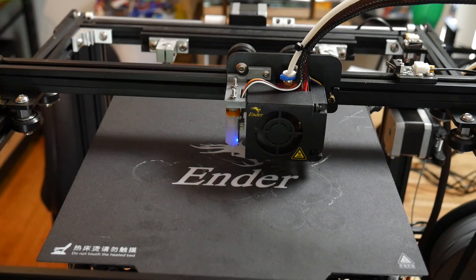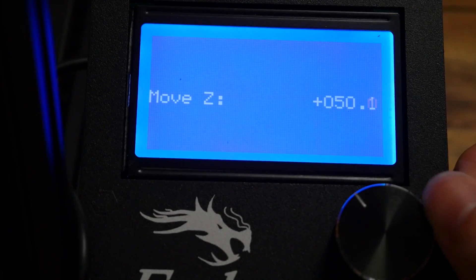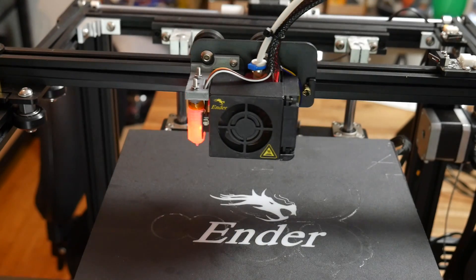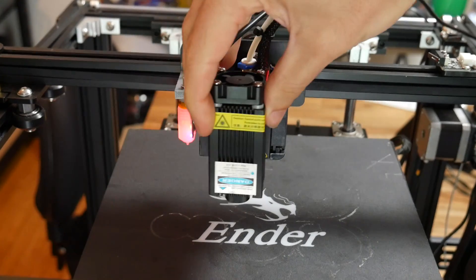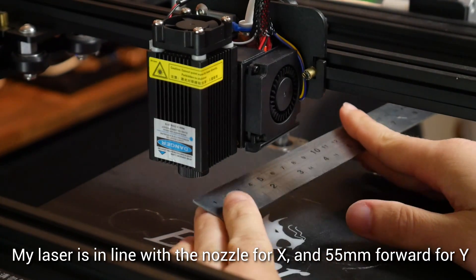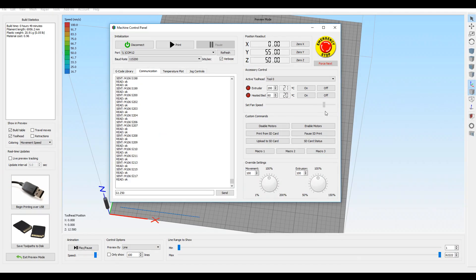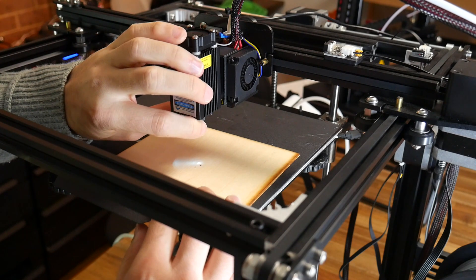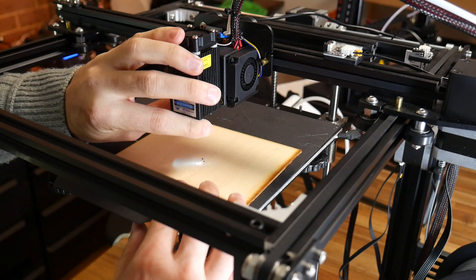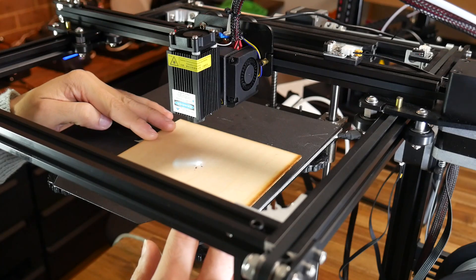When we make our laser g-code there'll be no homing, so we need to start by auto-homing the printer manually. After that we're going to raise the Z to a fixed height — I like 50 millimeters. Any movements you make after homing should be through manual control; don't disable the steppers and move it by hand as you'll lose your position. Installing the actual laser couldn't be easier — as long as you have a metal frame, simply take the magnets and push them against it. Measure the offset between the middle of the laser and the middle of the nozzle; I measured 55 millimeters. Finally, focus the laser by turning the part cooling fan all the way up and twisting the focus ring to get the smallest spot possible, moving the wood around so it doesn't burn in the same place. This focus will stay calibrated unless you use a vastly different thickness material or change your starting height.